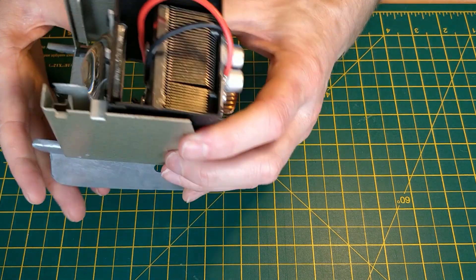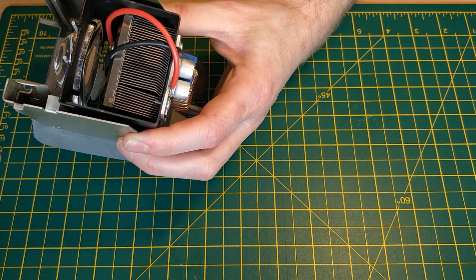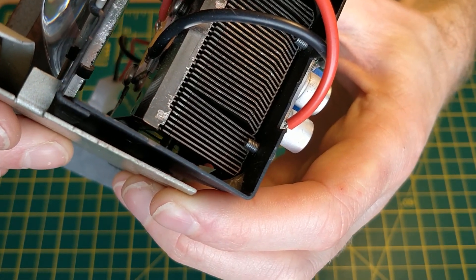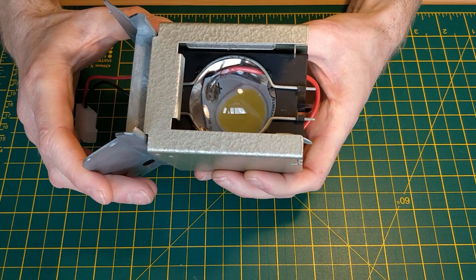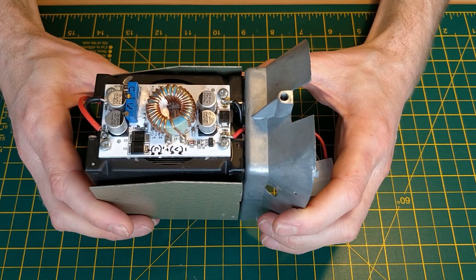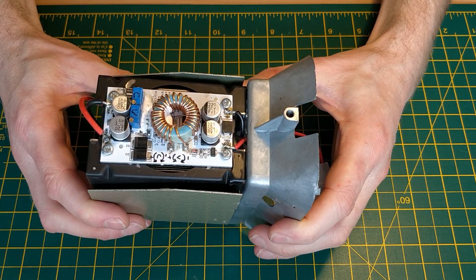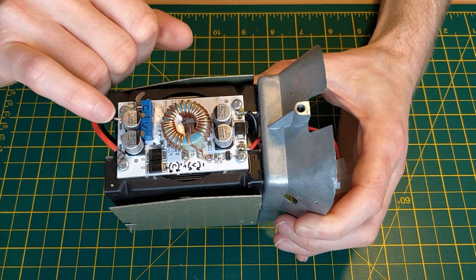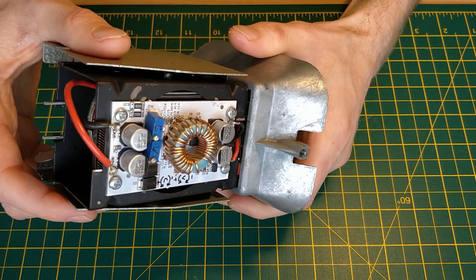The higher the lumens per watt, the less heat it will generate for a given brightness, so the smaller the fan can actually be. If you look down the top there, you can see the LED is attached to an old CPU heat sink, and there's some thermal paste on there as well. The LED itself consumes 900mA at a nominal voltage of 35V. So in order to drive it properly, I'm using a step-up constant current supply from eBay. It steps the 19V from the power supply up to 35V and limits the current to 900mA. It does get pretty warm, so I've screwed it down to a metal heat sink to dissipate the heat. You can see the potentiometers on the back for voltage and current. I'll put links to the power supply and the LED in the description below.